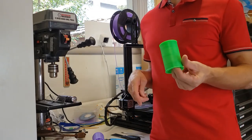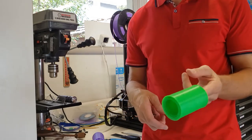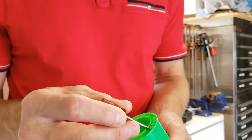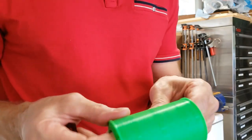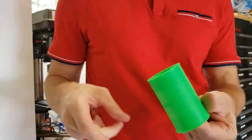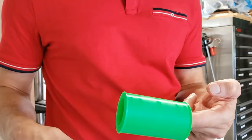Here we are out in the garage. One thing I forgot to mention is that when you first take this off the print bed, you'll probably need to loosen the needles — make sure they're all broken free and turning smoothly. Then you'll want to really work at it back and forth in different directions to help round off those bearings. Do all that prior to applying lubrication so you get the best results.